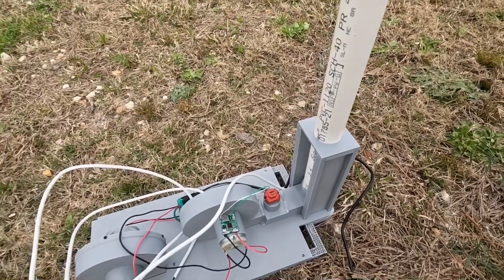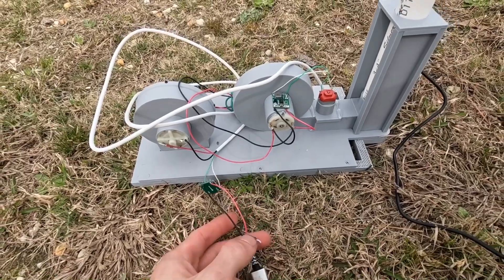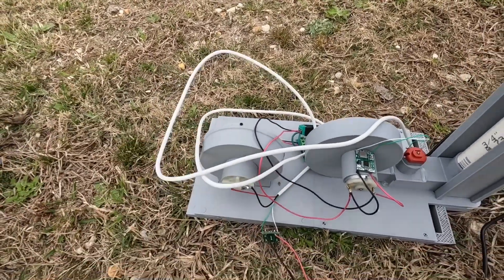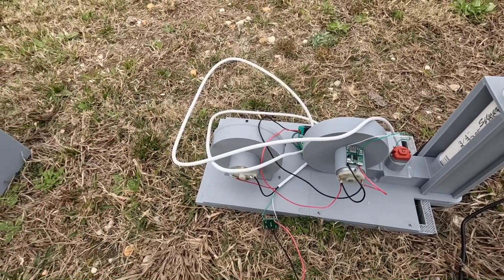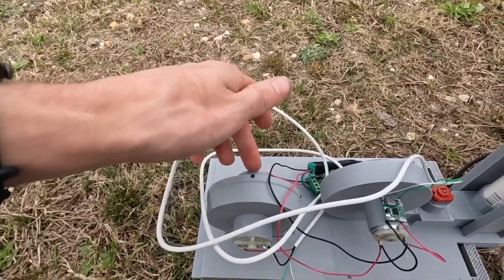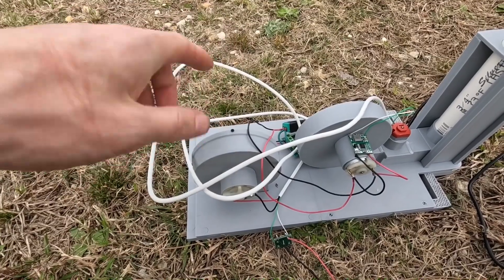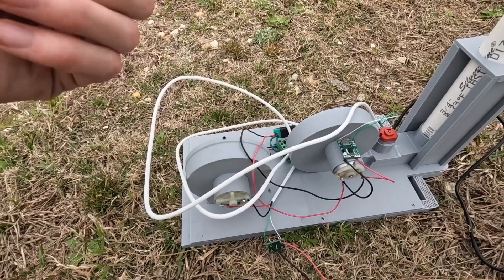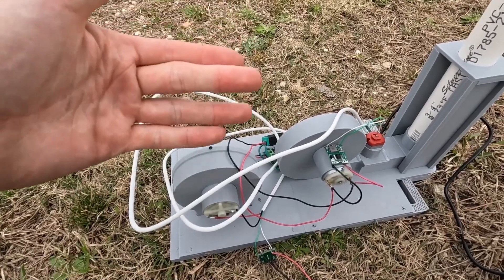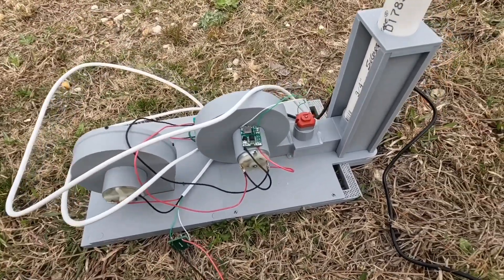I hadn't really gone through what everything is doing in here, so I'll try to make it brief. Right here I have this rigged up basically just to run the rotator, but it will be self-contained and much cleaner. This is the gyro cap — essentially a mechanical capacitor. When you send power to it, it runs this motor which spins up this flywheel inside this casement, which then goes to this generator. I have a separate generator because I want to make sure the wind-up is proper; otherwise, hooked directly to the motor, it would wind up really quick and then coast for a long time. So the entire chopper assembly runs off this separate generator.